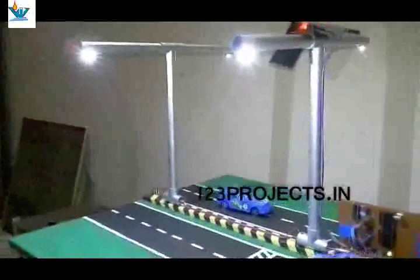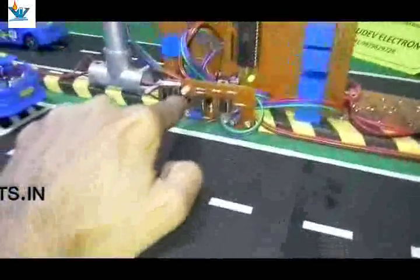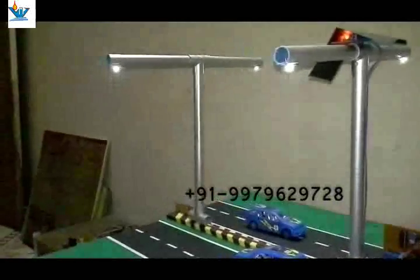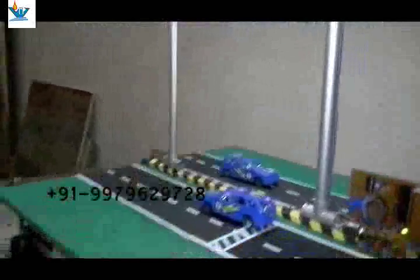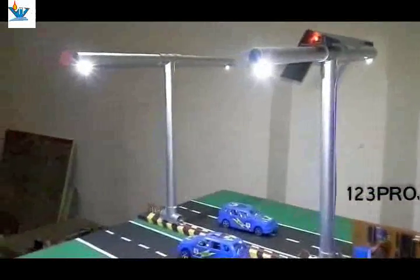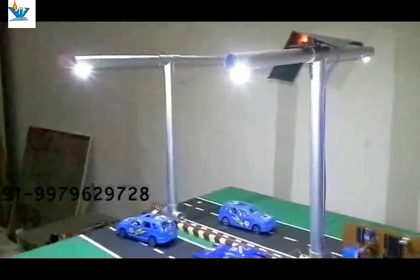The system can be scaled for a one or two kilometer area — if there is motion near this sensor, the area coming ahead is lit up automatically. After no motion is detected, it makes a delay, and if there is another vehicle behind, the timer resets automatically and the light remains on for the counter time. When there is no motion in front of the motion sensor, the lights switch off or return to 10 percent intensity until the next motion.